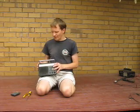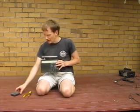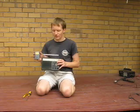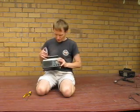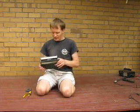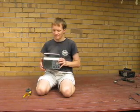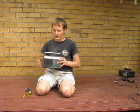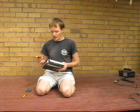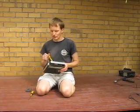You don't need very much to start. You need the receiver to be converted, and then you need another receiver that will help to tune it up. It just needs to be an old-fashioned slide rule dial type receiver, preferably battery powered. This is also a bit safer if you are converting it, as you will be needing to have the receiver on while you are making adjustments inside. You also need two screwdrivers: one to open the radio up, and the other to twiddle some of the controls inside it.